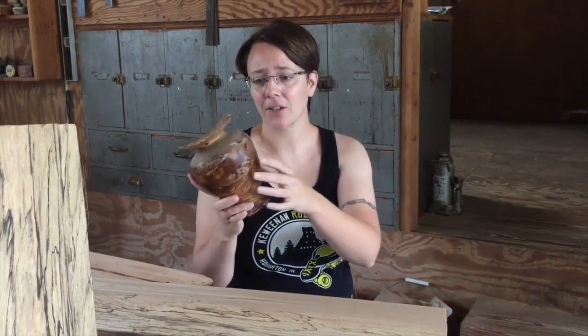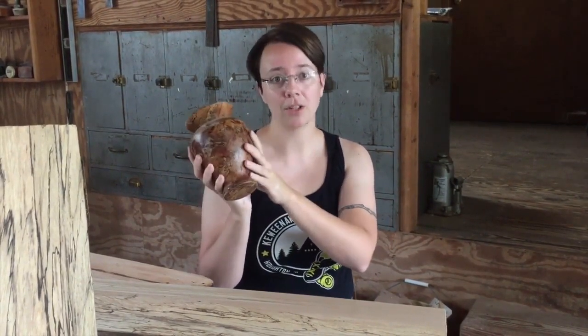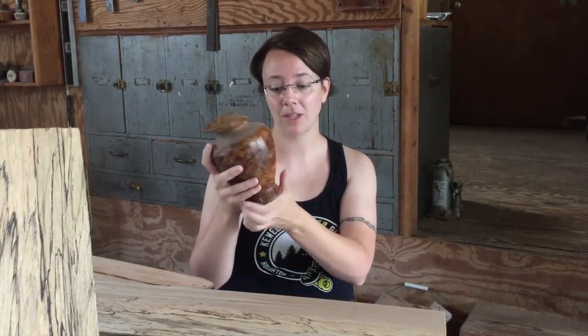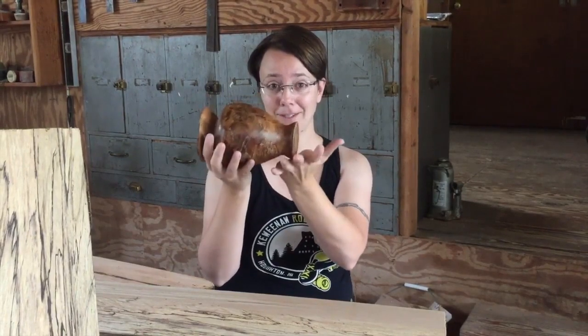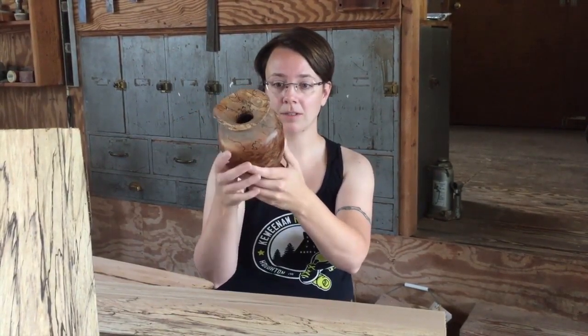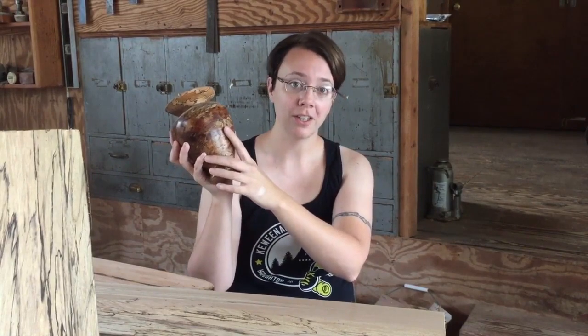Dale came up with this idea to pressure treat and methacrylate the wood, so put in methyl methacrylate. And that was part of Kip Christensen's research project for his master's degree. So this is one of the first pieces that was ever methacrylated, and its weight is quite substantial, but it did a really nice job of making the wood a little bit more uniform. You can still see density differences. I mean, they're still there. This was very early work, but it's a neat piece of history.